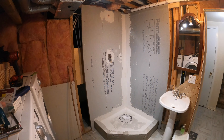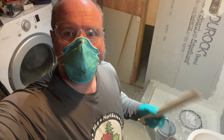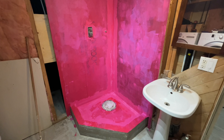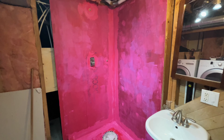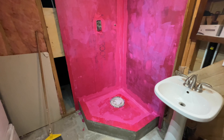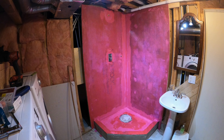Now we've got to vacuum and pull out the Redguard. It's going to take an hour and a half to two hours to set, but we have to leave this thing for 72 hours. Don't forget to stir your Redguard. Okay, that's coat one. I'm not much of a painter and I'm not super happy with this, but we're going to put a second coat on. We'll let this sit for about two hours then come back and put another coat on to fill in some of these hard-to-get spots. This concrete is porous — there are spaces in here that don't have Redguard in them, and that's why I want to come back and put a second coat on.